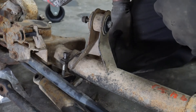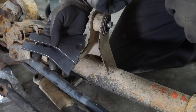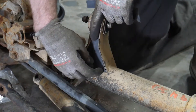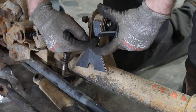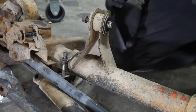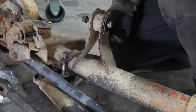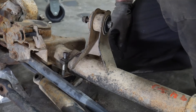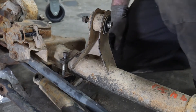What we wanted to do was try to make a kit to avoid that issue in the future. We made a pretty simple kit here — it really just consists of two plates. The first plate will go on the front of the mount on the inside and basically allow us to weld it to the tube down here at the bottom, all the way up around on the inside of the mount. Then the same thing on the back side as well — we'll weld an additional plate back there to reinforce the back side. We've got our shop TJ in the shop today and we will take a look at how we weld those in.